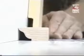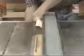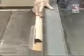There's a molding that sits on top of those feet. We'll make that at the router table. Now, those pieces of molding are a little wider than what I need, so I've set the fence for the final width, and I've tipped the blade about 3 degrees to give it a little back bevel so the front edge will fit nice and tight on top of those feet.